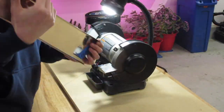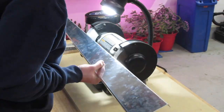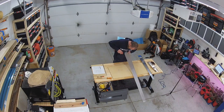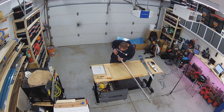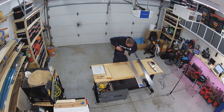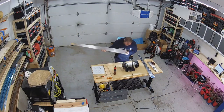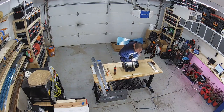You'll notice I have two different Scotch-Brite wheels on my bench grinder — one medium and one fine. That medium wheel is a little on the aggressive side, in my opinion, but it's good for the stainless parts and the much thicker aluminum parts. For the ribs, with how thin they are, I think it's best to use the fine wheel. Go ahead and subscribe to my channel so you can follow along, click the bell for alerts on new videos, hit the like button, and leave a comment below if you've got advice or questions.